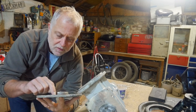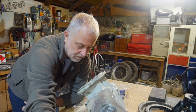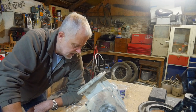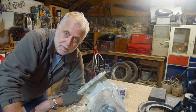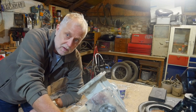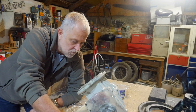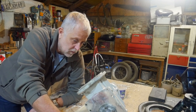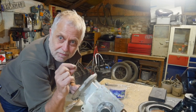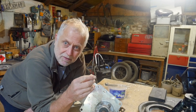If I look very carefully, there's some staining next to that screw hole where obviously it wasn't quite tight, and a little bit of salt water seeped into that screw. Big galvanic action there, obviously, probably stainless screws. And as you no doubt know, stainless into aluminium in a salt water environment seizes up incredibly well. And that's what had happened. So the head broke off, leaving about 3 to 4 millimeters, 3 millimeters shall we say, 1/8 of an inch sticking out.